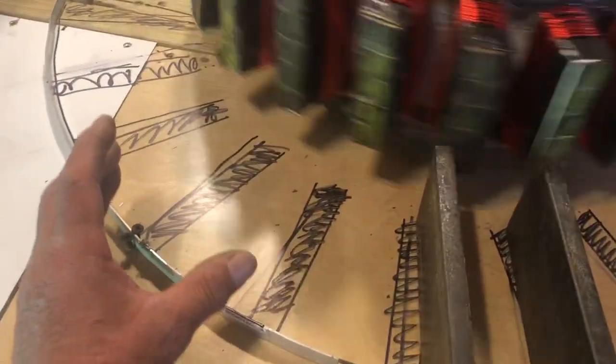So how I got the circle, I stretched that out, measured the length with a good quarter inch gap. Wheel's not 100% turning perfect, but it's the closest I ever had it. That's how I got my outside rim. All these bars will be welded to the outside rim, and each one of these will have their coils. These coils will be set up in an ABC fashion to where they'll be running off a controller that'll make this a three-phase dragged out situation.